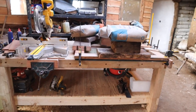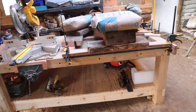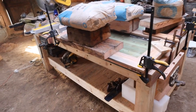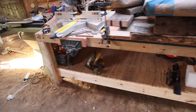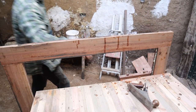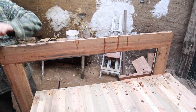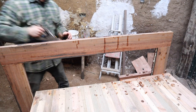It's quite cold. Used epoxy this time. Having trouble with glue not sticking because of the slight dampness in here and in the wood, and also because of the fact that it's such a dense, slightly oily hardwood. So I've gone to an epoxy now. Hopefully that'll give me better joins. It's taken me quite a while to get to this point because the cold weather and glue drying times have made it kind of difficult. I'm just waiting on it.